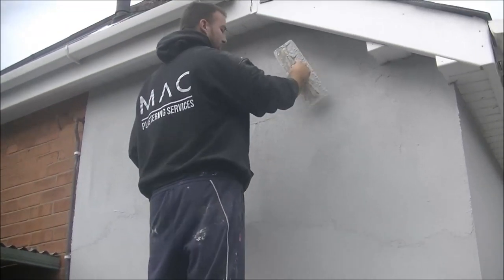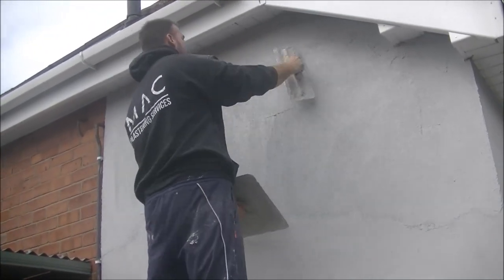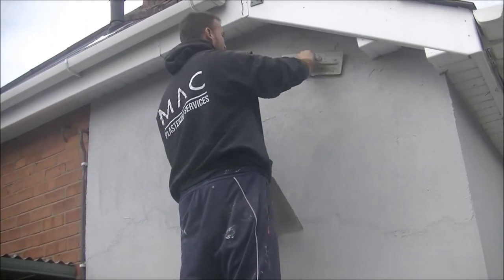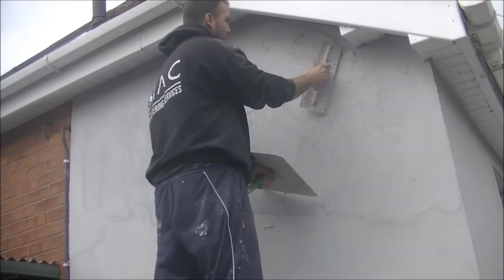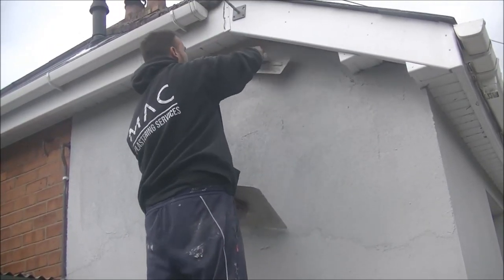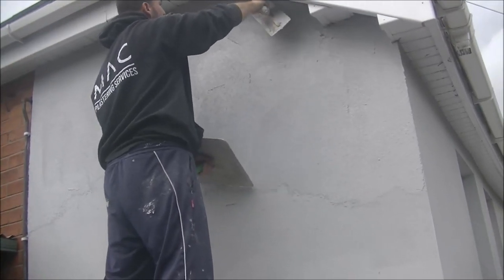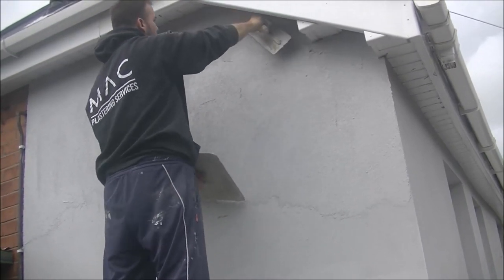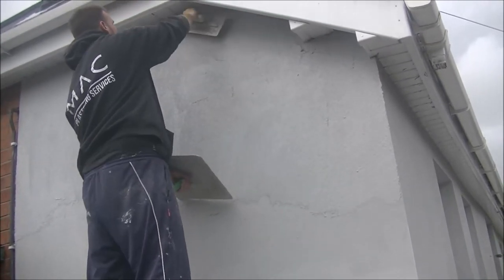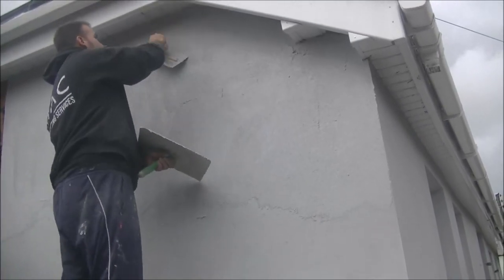Also, I'm going to finish this section shortly, as like I say, you don't have much time when it's on the wall. I would say this stuff tightens quickly when it's all spread nice and thin, but doesn't set quickly. Not sure if anybody will really understand that. People who use monocouche renders will understand that. When it's spread, it'll tighten, but it won't set solid.